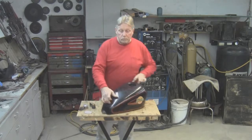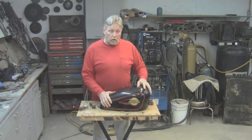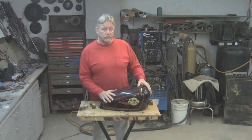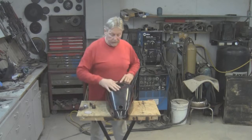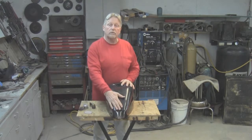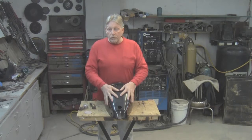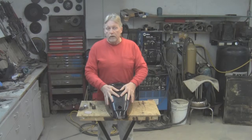Well, basically, most people that do their own cutting, unless they've been into some type of layout or drafting or even carpentry, anything, and they know the true line of center when they see an object, both of these holes are out of center. So I told him about it, and he says this tank isn't that important, but he would like to have it put together. You're better off to let the fabricator do the layout work as you want it, and they should take the responsibility of center, straight, plumb, whatever it is.